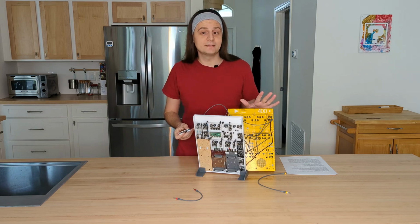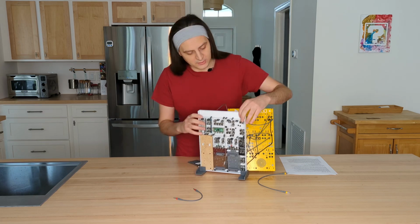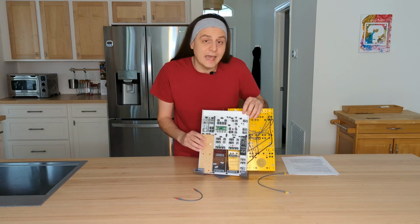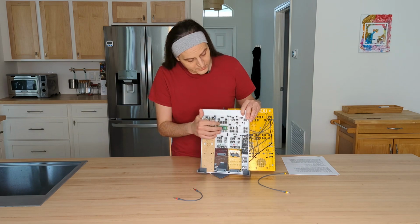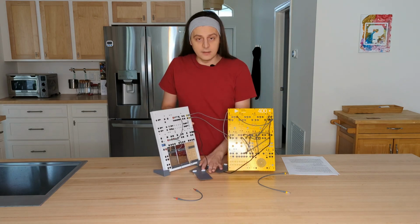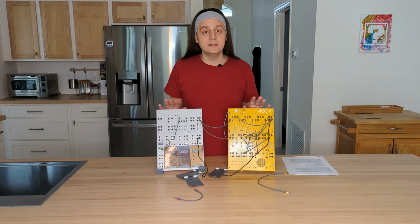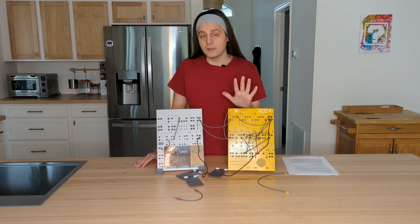If you do PCB design, I strongly recommend modeling your board first. Laser cutting, if you have it, is excellent, because then not only can you make sure it feels correct and the sizes are all good, but also test all the fit, and make sure I've got all the right parts for all the right footprints here. I've tested a lot of these on breadboards, and a lot of it works, but I'm still working on it. I do plan on making all of these designs freely available once I get the real boards, assemble them, and test them out a lot to make sure they all work.